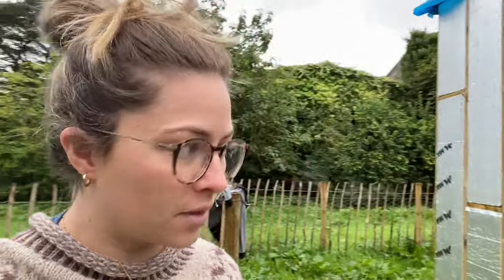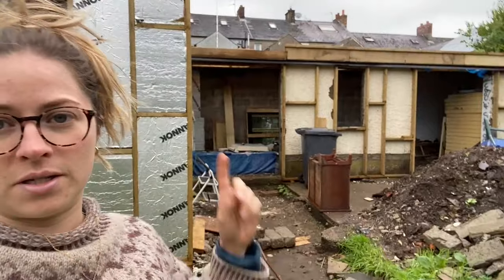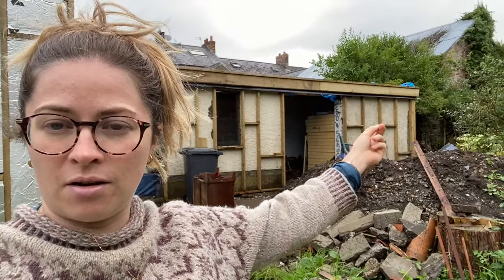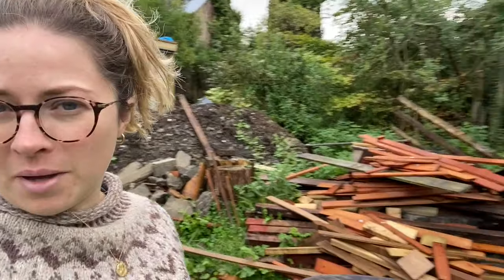My dad's been working on getting the insulation in which is really good. He's done two sides so far, which is so helpful. I kind of thought I'd be able to do more of this but I've just been dying. We still need to put the insulation here, here, and around two of the sides. Then we can put on the vapour control layer and then the cladding, but we can't do any of that before the roof goes on. The only thing we can do is the insulation and the vapour control layer. So quite a lot of work and quite a lot of mess, to be honest.